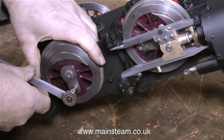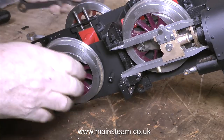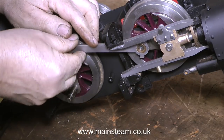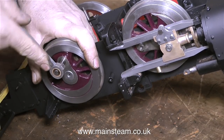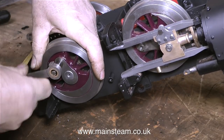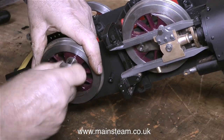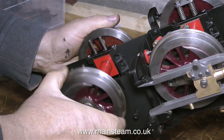It's always amazed me how much steam locomotives really are a mechanical anomaly. It looks to me like before this engine was put into storage, someone had a quick go at redoing the rods. The coupling rod is a very tight fit on the rear crank pin — it's a bearing fit, and would be fine in an internal combustion engine, but it's the last thing you want for a coupling rod. This would prevent any articulation. If both rods were held together, how is it going to go over bumps and around corners? It has to be able to move freely.